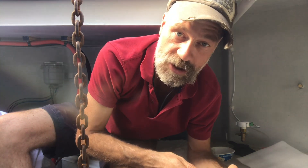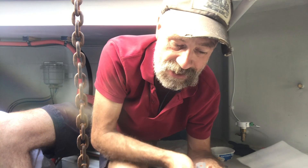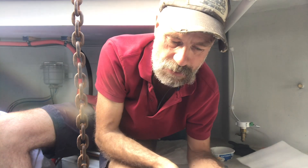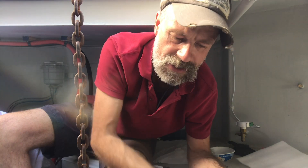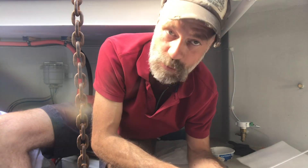Not the end of the world though. The plan is tomorrow I will go across to Andycraft and see if I can get a couple of ten millimetre thick steel plates to use as shims, which is what most people do. So I'm going to have a shim on the shin — but what else can I do? I've got it aligned enough that I can progress with other things while I'm waiting, so it's not a sudden screeching halt.